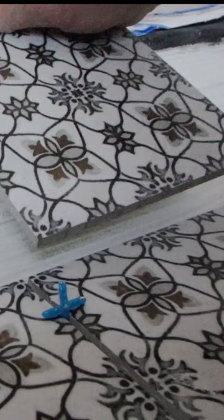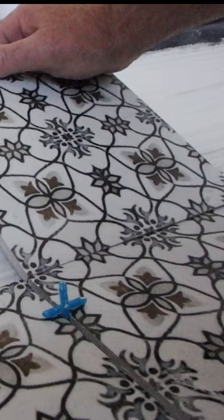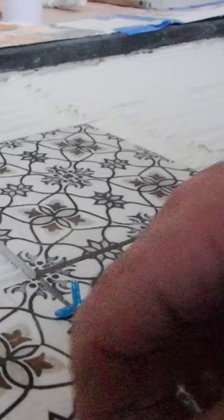If you're setting some small tiles, like some 8x8s or some 12x12, do a little trick to avoid things that squeeze through the grout line. So when you set your tile, put it right up against the tile, move it back and forth, and then move it out to where you're going to put the thickness of the grout line.